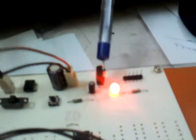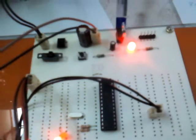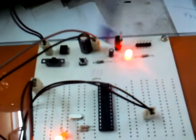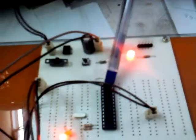This output voltage is fed into a voltage regulator, the 7805, which provides a constant regulated 5 volts DC output. After the regulator, there is an additional 100 microfarad capacitor to protect the controller and remove any remaining AC ripple from the output.